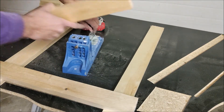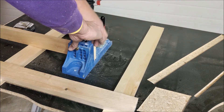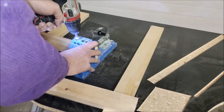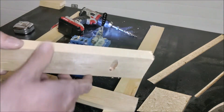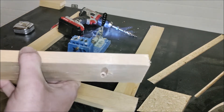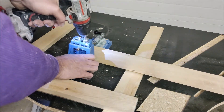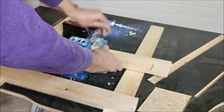We're now getting ready to start cutting our holes using the Kreg jig. While the height is extremely important, the actual spacing left or right doesn't matter as much. I usually line it up to the edge of the jig for uniform spacing as I go from side to side, and drill until the stop at the top of the drill bit contacts the jig. It should also be noted that you have to use special screws — they vary in length. In this case, the screws are set up specifically for joining three-quarter inch material to three-quarter inch material.